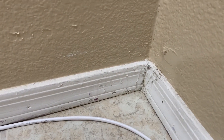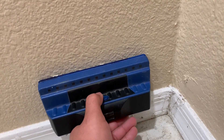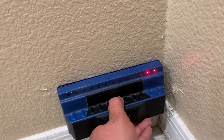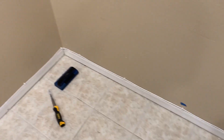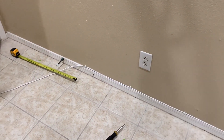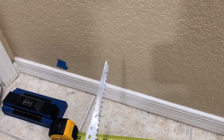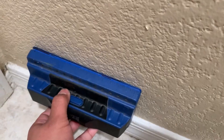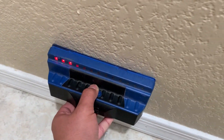I will go past this corner, but you might ask yourself why not pass the cable through the wall now and continue on the other side. The simple answer is that there is a stud on the corner of the drywall and this is a highly visible corner, so I do not want to create a hole here. I'm making my way around the baseboard, but I will stop adding staples when I get to the place I will feed the cable through the wall. Before I make the hole, I will check with my stud finder. If you do not have a stud finder, use a small nail and test a few inches away from the corner.